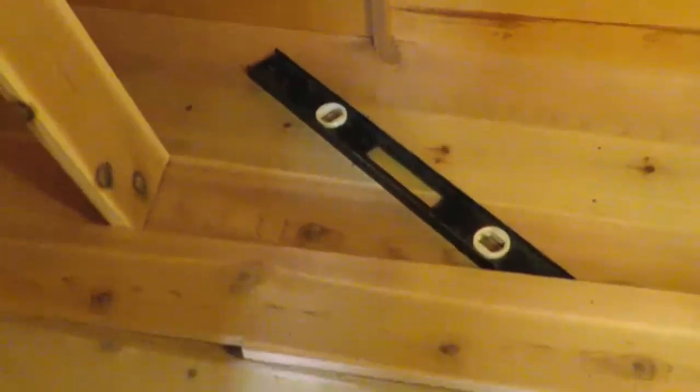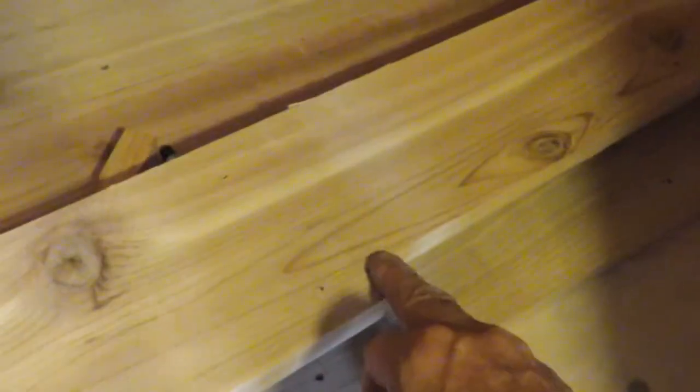I'm slowly gaining on the floor — I have four of my 1x6's in. This last one is tricky because the distance between the wall edge and the board line is less than the width of the board. I put in a short piece of 1x6 and drew a line on the outside the whole length from one end to the other. Then I laid a board in, squared off the edge, measured the distance on each end, marked those measurements on my board, and cut it out with a jigsaw.